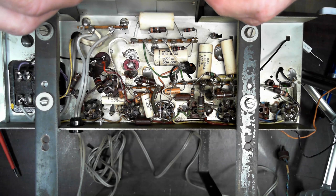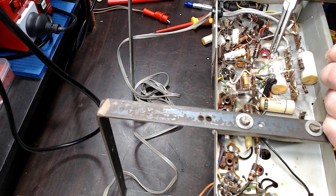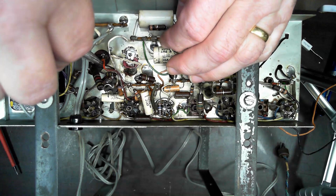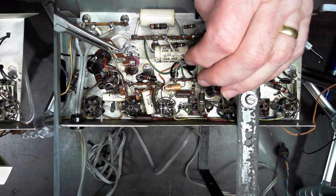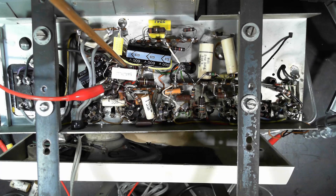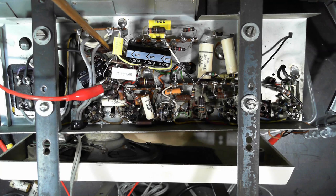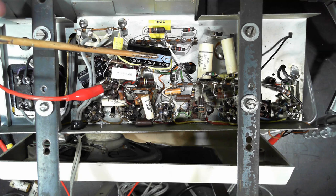This electrolytic is no good so I'm putting a solder tab on. I've taken some of the edge off that pin sticking up and I'm soldering it down so I can attach both caps. I realized that one has three connections so I'll need a longer tab strip. I've spent the last two or three hours putting in a tab strip and some new electrolytics to replace the two that were there originally. I've done three caps, and this resistor is a new old stock one that makes up the grid bias, keeping the center tap above earth.